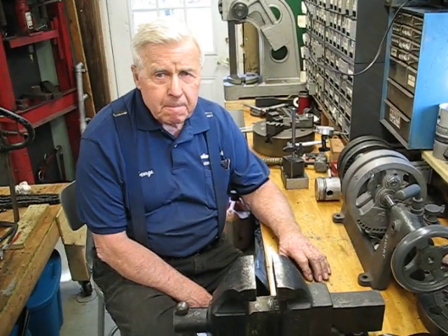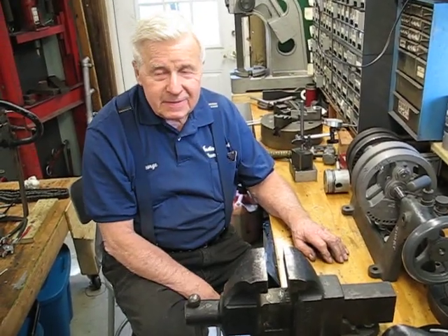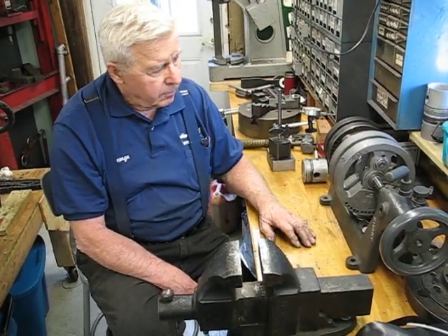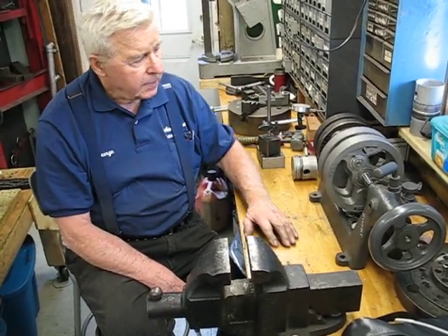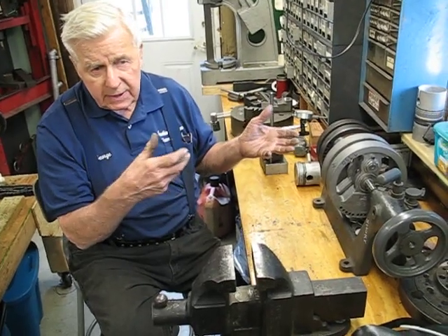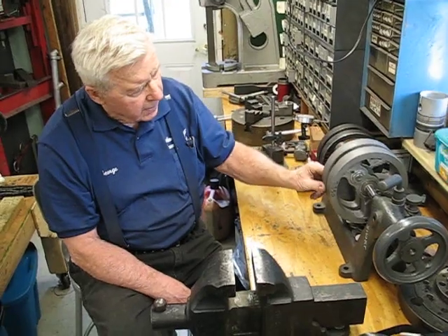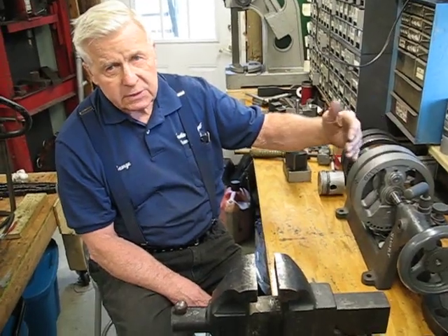Well, Mr. Uraki, I've been watching you for nine and a half hours now out there on the bridgeport. What were you doing out there? Okay, here's what we did. We assembled the flywheels with all new pins. We honed the new pins into these flywheels. These are the flywheels that originally came out of the piece. Now, when we put the whole thing together, we couldn't get less than five on one side and about maybe two on the other. So that's unacceptable. So we assumed that back in the day, Indian just didn't quite get the crank pin holes in perfect.